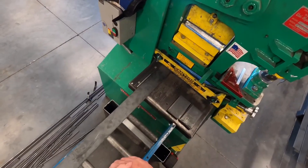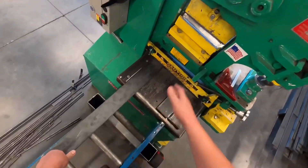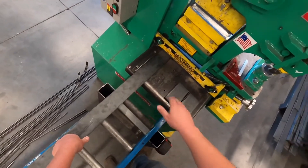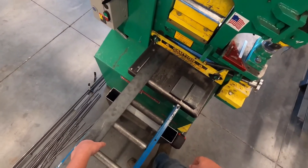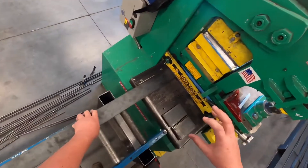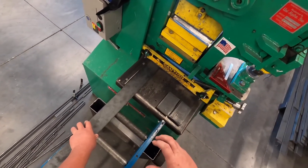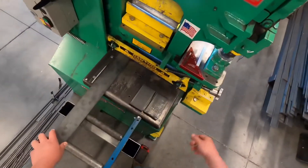The second purpose of the tension bar is to keep your fingers out of the blades. It's used to keep your fingers and other items out of the blade when you're making a cut. When tightening this, we're only going to go a smidge past snug — maybe like a quarter turn past snug. If we go too tight, the all-thread can strip, and we don't want that to happen.